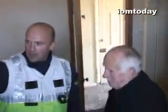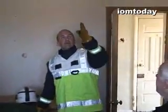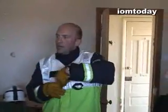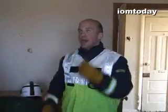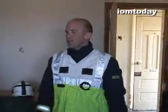As you can see, there's a slight air gap around the side. We're going to start the fire in the corner in that unit — just open it up, there's only wood in there. Once the temperature comes over 57 degrees centigrade, that plate drops off, the sprinkler head then drops down. So if you're doing wallpaper, you don't wallpaper over them, you don't paint them, but you can actually tell the company what colour you want — so if you want a purple head, you can have a purple head.